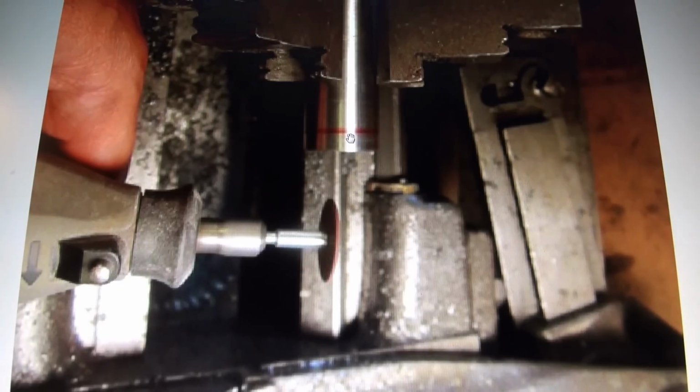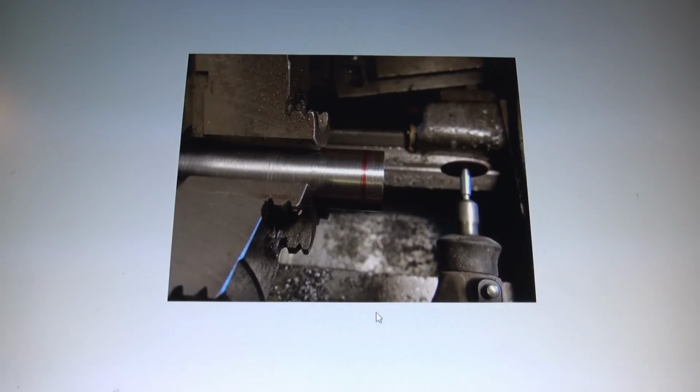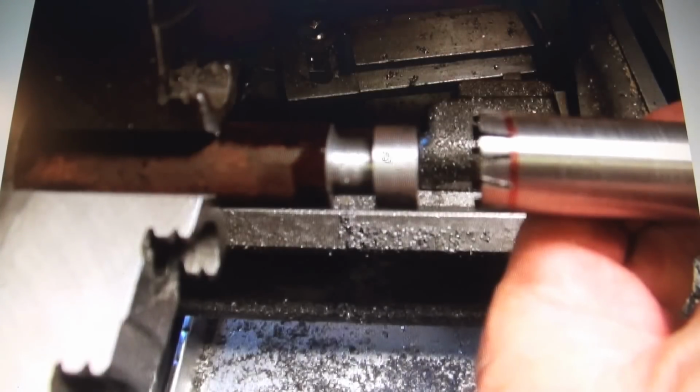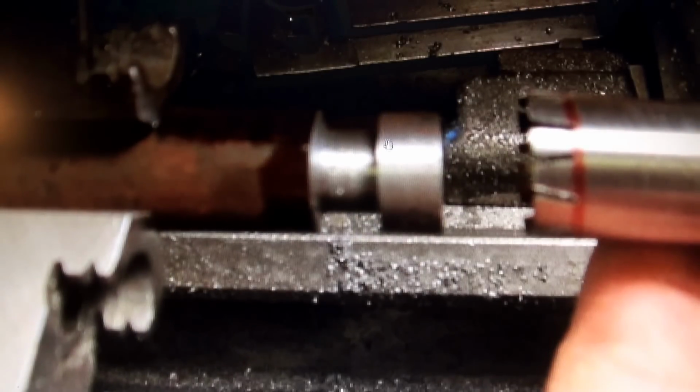So here I have a mark and I have the Dremel ready to cut up to the mark, and then the cuts are made, and here we are with the cut pieces. So getting back to that steel piece, I made this little thing up here, just machined so that this fits here with a little bit of space. The idea is to slip it over here into this area, and I can use this edge here as a clean break and bend over so it's uniform.